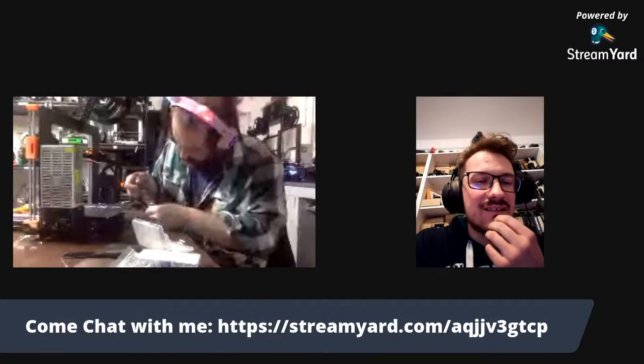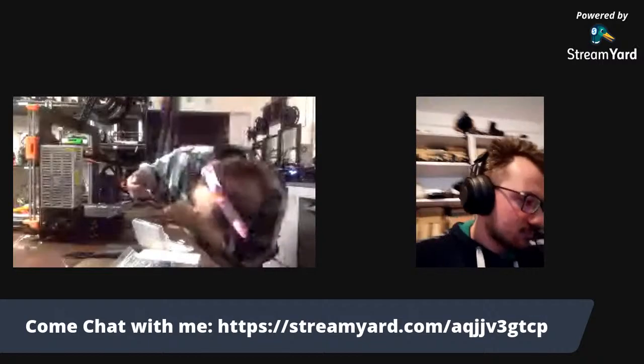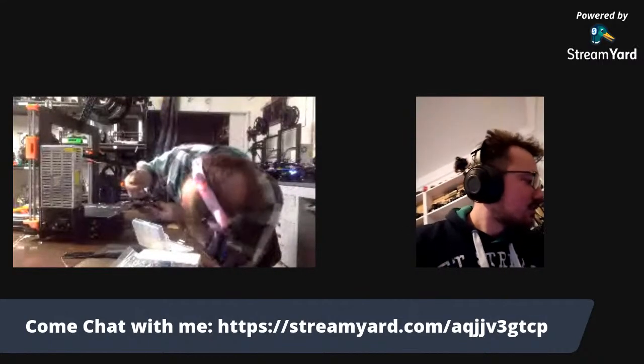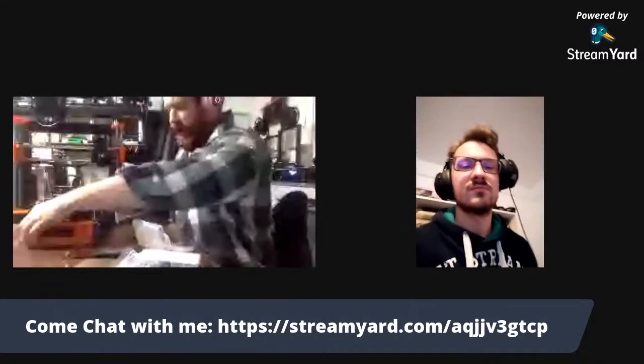It's feeling pretty solid. Here, I can get 2 of the 3 screws in. This is a Prusa i3 Mark III. This is actually a Chinese clone. I have an original and I have a clone. The clone is actually good, pretty much identical in every aspect to the original. I bought it as a test because I really like the original, but the farm is almost all Enders, because while this is slightly higher print quality, it takes me longer to disassemble this head and reassemble it than tearing a whole Ender down and building it again. It's a very reliable, good printer, but if they go down, it could take me 3 or 4 hours to fix one, and that's just not good for printer farming. So the Enders are simpler, and I like them as my farm printers a lot more.